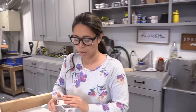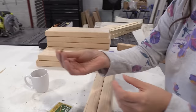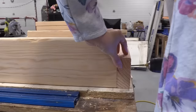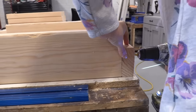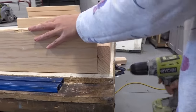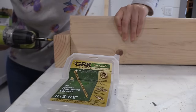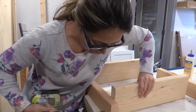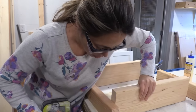I'm going to start by building up two of the ends of the coffee table first. For construction I'm going to use these two-and-a-half inch trim screws and wood glue for the assembly. These screws make building so easy — you don't have to pre-drill and the screw head is so small it hides right in the wood. The only downside is they might not pull the wood in as tight, but if you're using good lumber you shouldn't need that.